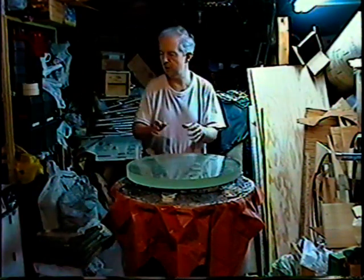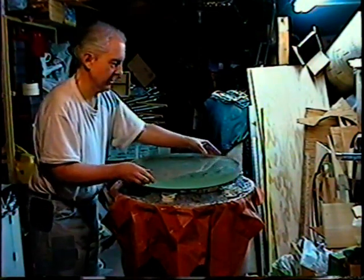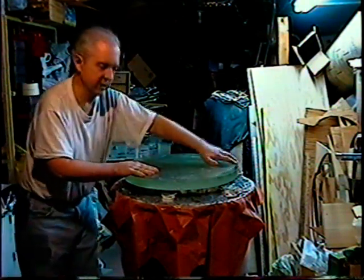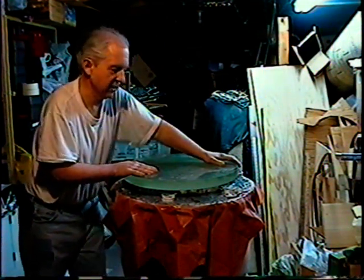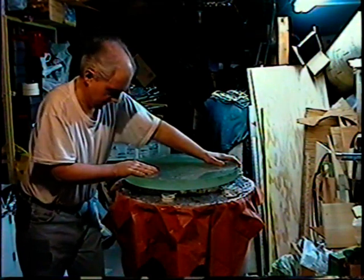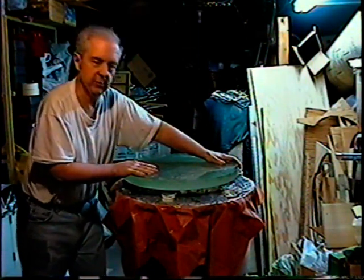I believe I started the first charge over here, so I'll memorize them more carefully. I'm going to rotate over approximately here to start this one. I'm going to push down fairly hard, especially at the start when the cutting action is at its best — as hard as I can during the first couple of passes — just to make sure I get as much cutting action as possible. This is recommended in Texereau's book, 'How to Make a Telescope,' during the rough grinding.